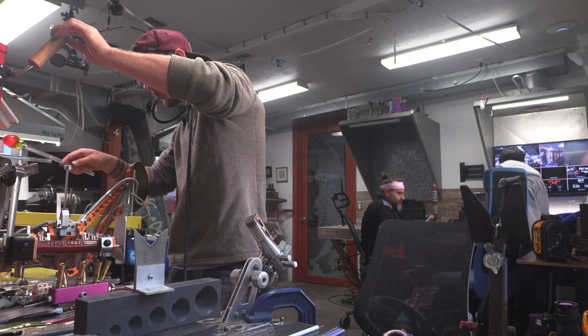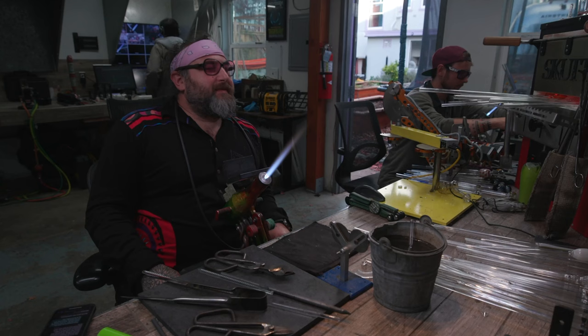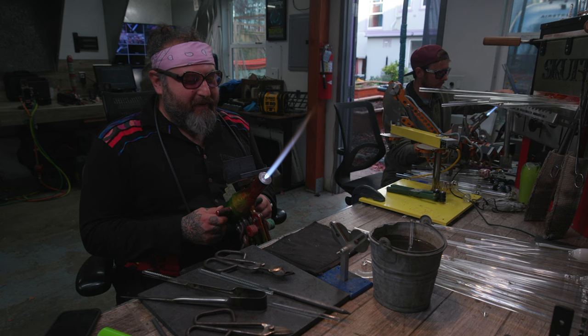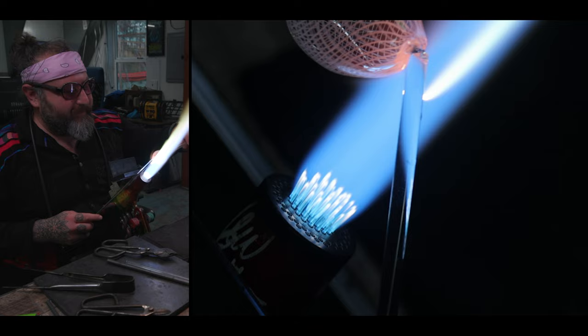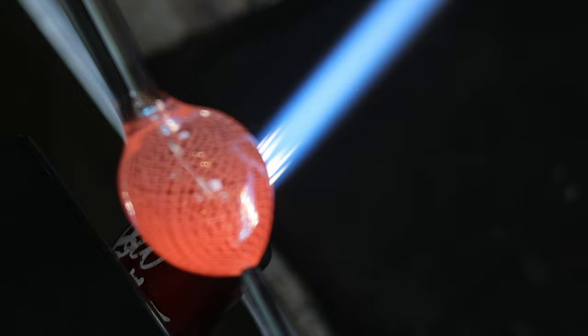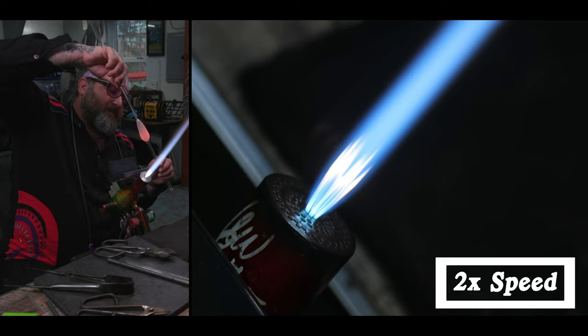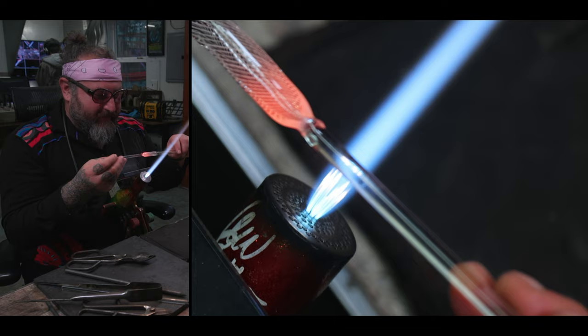It's a little tricky. Do you ever worry about tagging the wall? As soon as I heat up the clear to pull it off, I start to blow into it so it's very thin. Just make sure there isn't any time when it doesn't have pressure coming from the inside — then it won't collapse. It's funny how you might do something a thousand times and one day come up with a way that saves only a couple minutes, but over the years that really adds up. I do a lot of those little cup flips, so saving five minutes each time builds an extra half-hour or more.